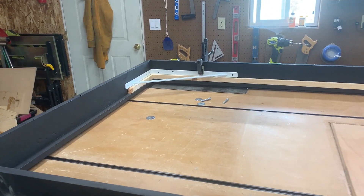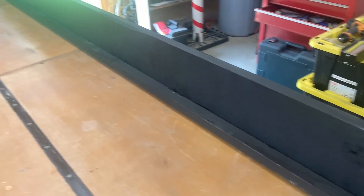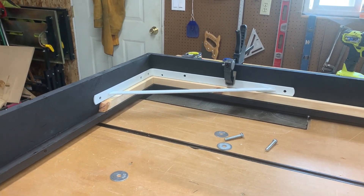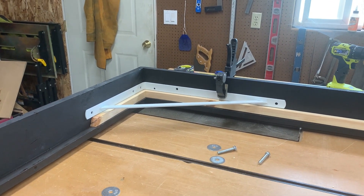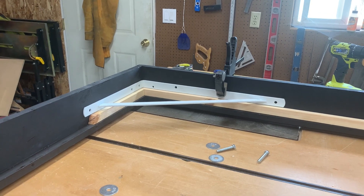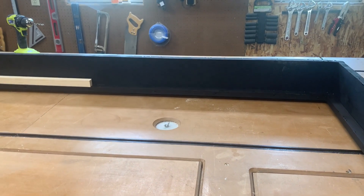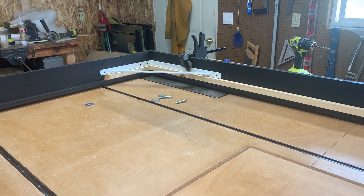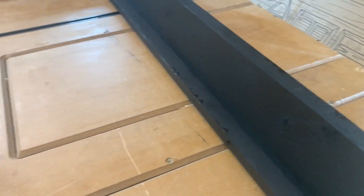You can see I've painted my box and got all the edges in place where the panels will be mounting. I've set up a corner bracket here — it's a steel shelving bracket from Home Depot. Two of the holes I had to drill out to make them 5/16ths for more strength, since the whole unit is going to be suspended from its top. I made sure I had those steel brackets in the middle to support that, and you can see the lips here where the panels will be secured.